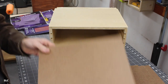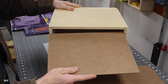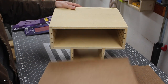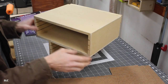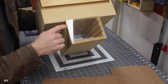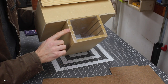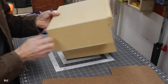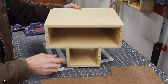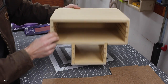For the shelving, I'm using some — I believe this is 1/16 inch or maybe 1/8 inch hardboard — and that works great just sliding right in place. I made them loose so I can always slide them out to get what I need, or if something gets stuck I can take everything out for easy access. For the back on the lower section, the backing was kind of an afterthought — I realized I didn't have enough room to do a full back without major adjustments. So I just had a piece of acrylic that I cut down. It makes it easier to see into the bottom, especially with the white background of the wall. Overall, real simple, real easy design. I hope you can make a sandpaper organizer yourself.